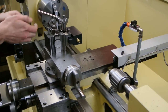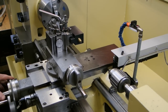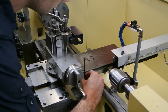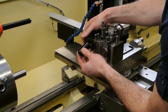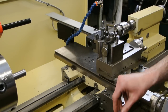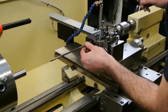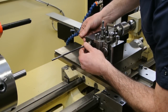Position the cross slide back to the relevant zero that was made earlier on its axis for the commencement of drilling, remembering in which direction the backlash was if no digital readout is available on your lathe. The cross slide now needs to be locked into position. The driver on this Ventec is 16mm, so a reduction sleeve is required in the tool holder. The Ventec driver is locked into position with a grub screw on the driver's flat, which means the flute of the drill is facing away from you.